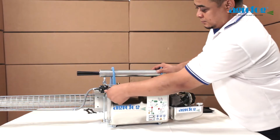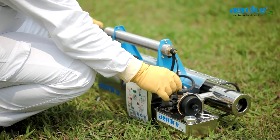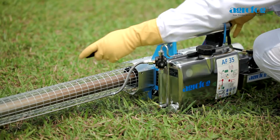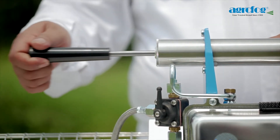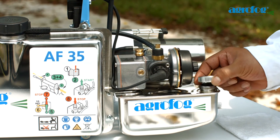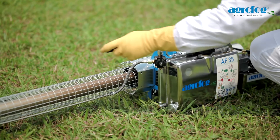The solution tap should be closed with its lever pointing upwards. To start the engine: first, pull the petrol stop button upwards. Press the starter button and keep it depressed, then actuate the air pump. When explosions are audible, actuate the air pump by another one to two strokes. The engine sound should be regular and even. The air pump creates pressure for the petrol supply — the lower the amount of petrol in the tank, the more pump strokes will be required. Always start the unit with at least three-quarter tank full whenever possible.